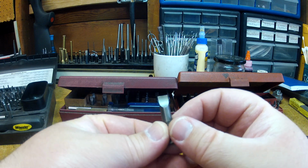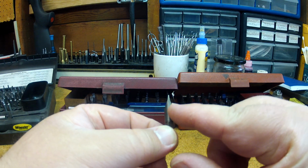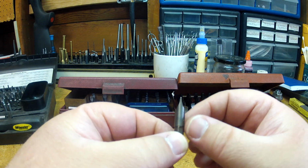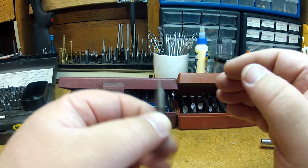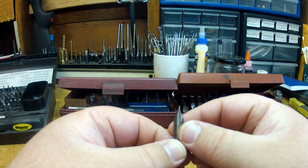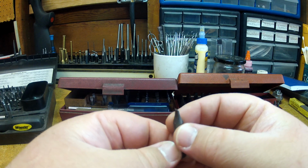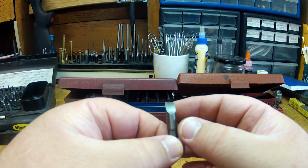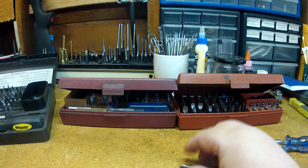So, first off, you're going to look at the shape. It's all squared up. It comes to a more abrupt tip. Okay? Your average screw for gunsmithing is a square cut, not a wedge. Whereas a lot of your woodworking flatheads, which I don't even know if anybody uses flatheads in woodworking anymore. I sure as hell don't. They have more of a wedge cut.